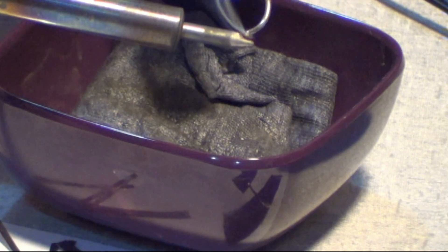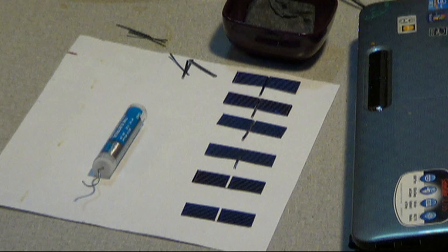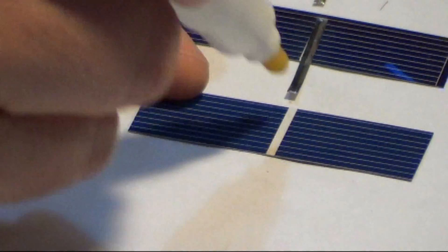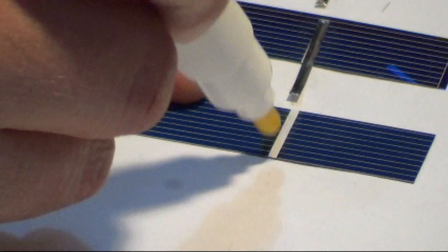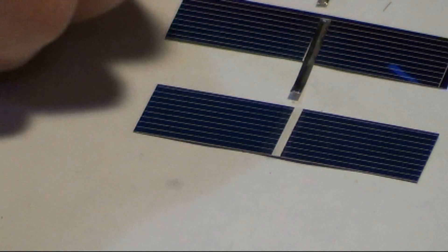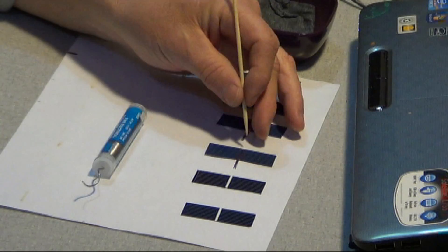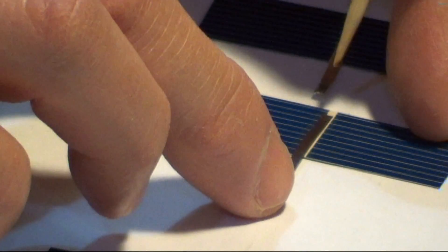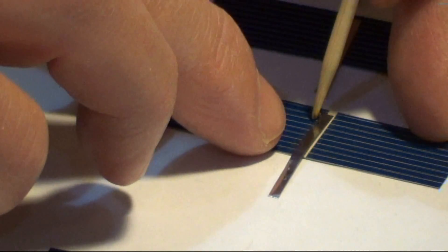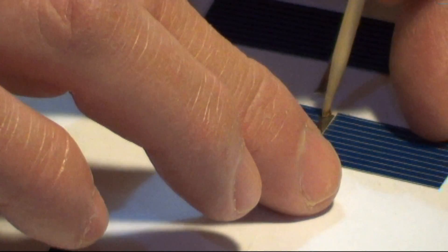This is going to help for perfect flow onto the wiring tab that we're working with. We're working with solar cells here today, and we're going to put flux rosin on the cathode side of this particular solar cell. This is a must — you need to put the flux rosin onto the tab, whatever you're going to solder to. That's your first step. It's a little tricky, but we use a wood stick here to hold down the tab wire.